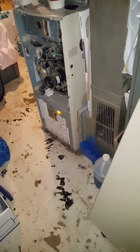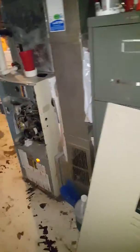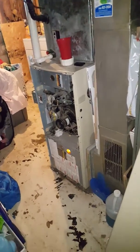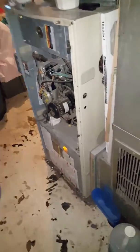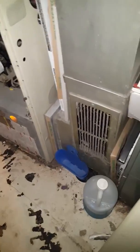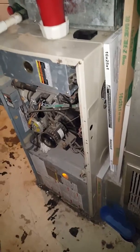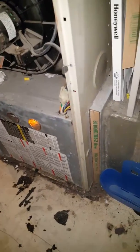This is a video at the Earhart Residence — basement furnace, tri-level house. It has a right-hand drop duct with a return air grill in the duct, which is not great because it's so close and all the air is coming there. It has a 16 by 25 filter, slide in on the side, with an 8 by 24 return air drop.